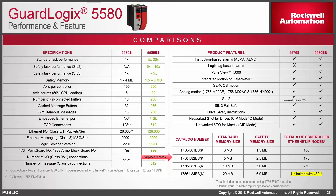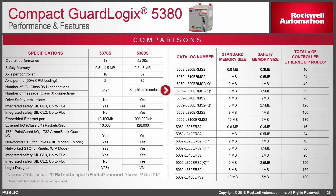There's a detailed comparison chart between the L7 and the L8. With the L8 there are only four catalog numbers, sold by number of nodes and size of memory, and with version 32 and an L84 you can go to unlimited nodes. Similarly, the Compact GuardLogix 5380 now offers a huge range of ethernet nodes and memory options, with conformally coated variants — giving a wide span of controllers to select the right size for your application.